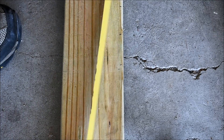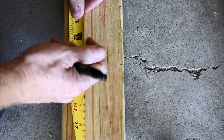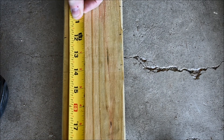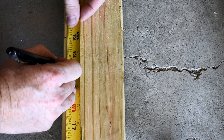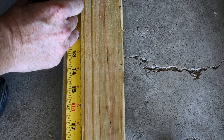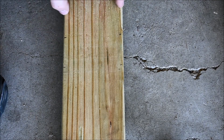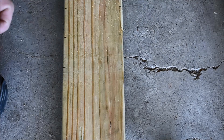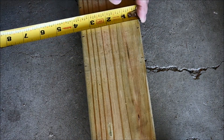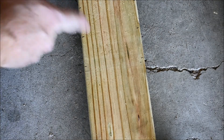Here's how I'm getting it centered — it's 24 inches long, so I find the center point at 12, then go back an inch and three-quarters on either side. That takes me to 13 and three-quarters and 10 and a quarter, which gives me the width of the two-by-four so I get a nice center. The two-by-four is actually one and a half by three and a half — not sure why they call them two-by-four, I guess it's just easier when they round up.